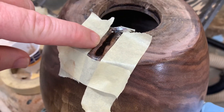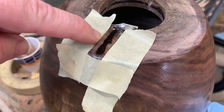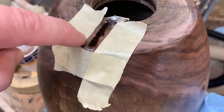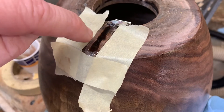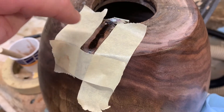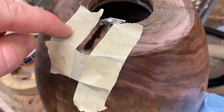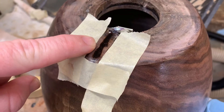One thing I want to do is try to keep the epoxy that I've put in here really isolated on the crack. So I put a ring of hot glue right around it as close as I can, and then if I put the epoxy in, it keeps it from spreading out. Then the hot glue just peels right off and I can use a chisel or something else to clean up the epoxy really quick and really easy.